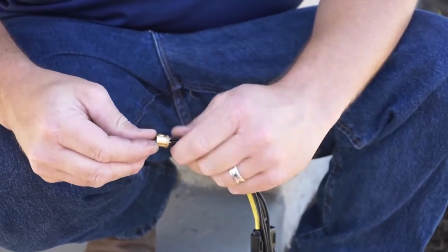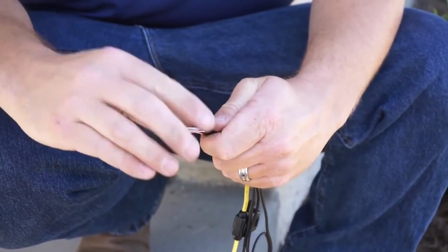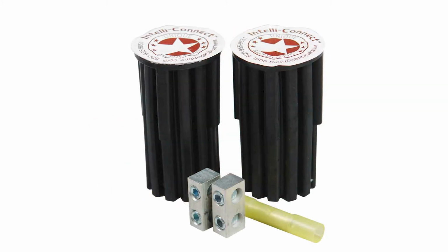This connection is reversible, so that fixtures can be added by simply removing the screw and slipping in the additional wire. IntelliHub can accommodate more wire and fixtures than a satellite hub, so a larger lug is included. The IntelliHub connector has a larger cap and cover that includes an Allen nut to secure connections rather than a screw. Like the satellite hub connector, the IntelliHub connector is reversible so that wire can be added with ease.